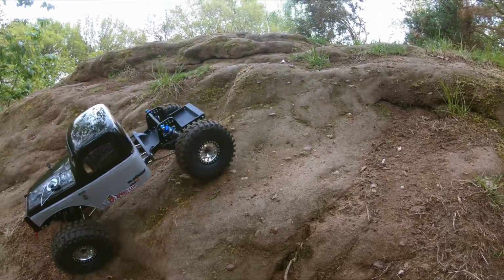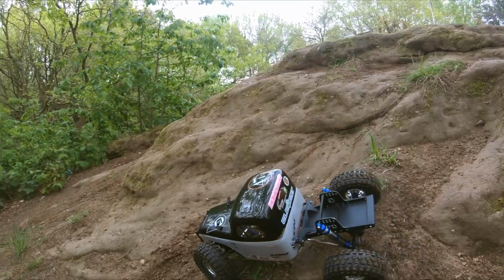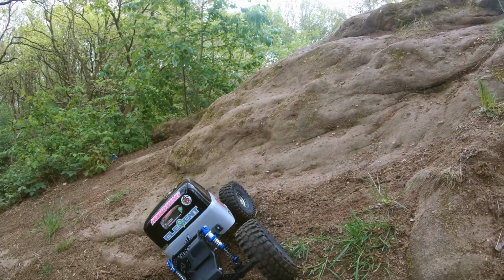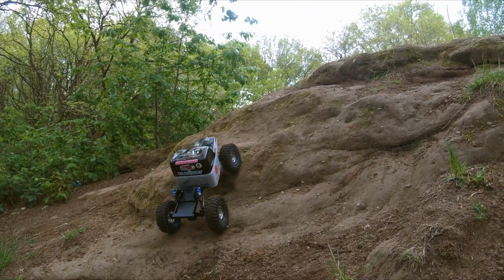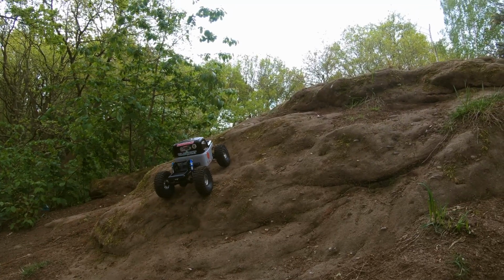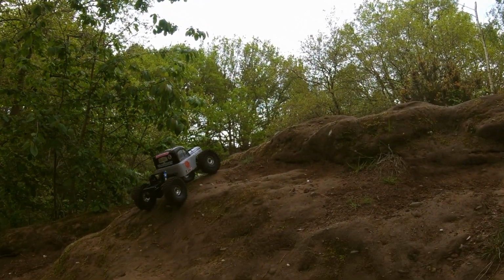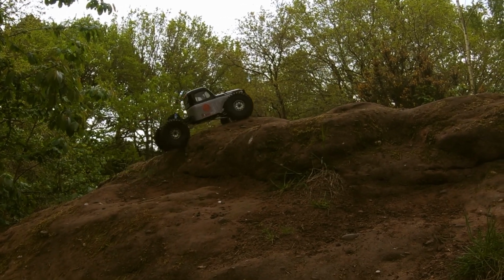So that's it for this video. I'm just going to leave this now with some running footage from the tests that I did after we finished the build. I'm really, really pleased with the way it's driving. There was quite a bit of torque twist in there initially, but I've managed to tune that out just with a bit of preload on the springs of the shocks. So that was fairly straightforward. And other than that, it's performing really well.